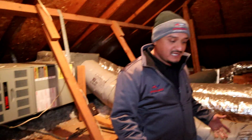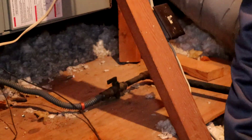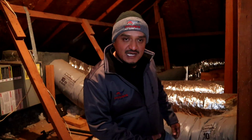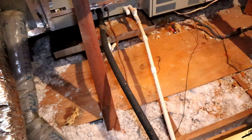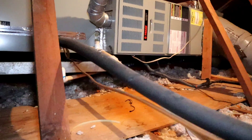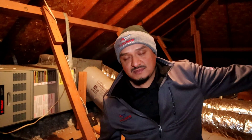As we line out our install team, we like to look at what we can improve. One thing that really sticks out is our gas lines and drain lines. Our original gas line is not strapped — super loose — so we're going to be modifying that to make sure everything is nice and secure. Our drain line is almost like a guitar string right there, so we're going to be rerouting that as well, making sure we have a clear path to prevent any blockage and keep everything right for the customer and the life of the unit.